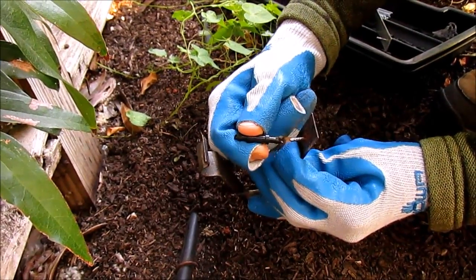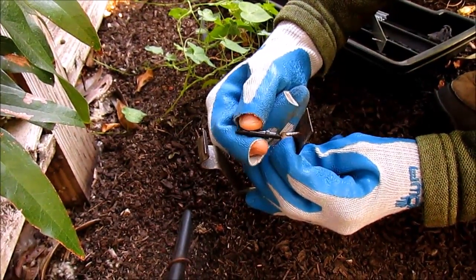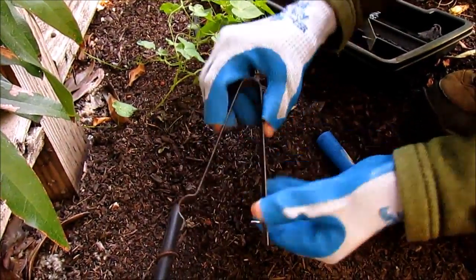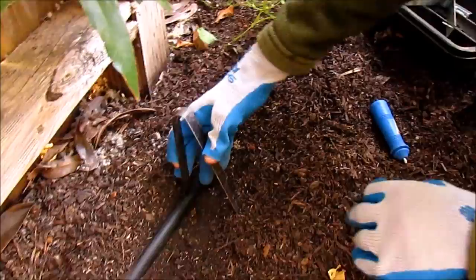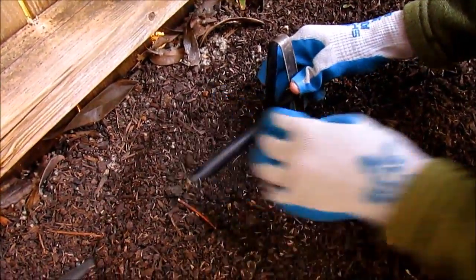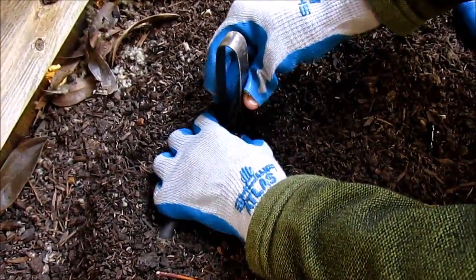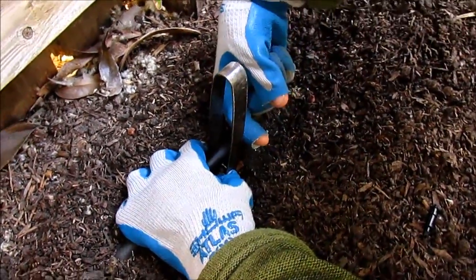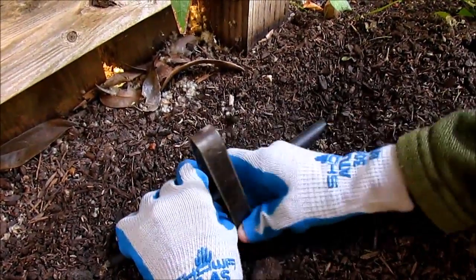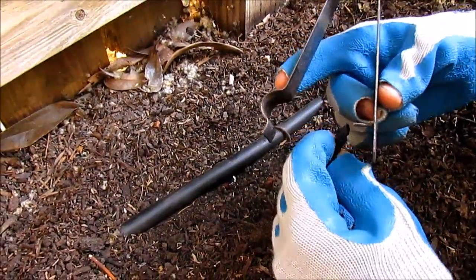If you have to force this connector onto the hole punch, it's not going to come off once you punch it into the main line. Let me show you how this works. I'm going to nestle this back part in — I'm going to punch the hole so that it's coming out the side, not out the top. So I've punched the hole — pull it straight out, no wiggling, because you don't want to make that hole bigger; it'll create a leak.